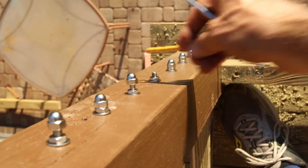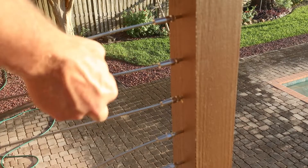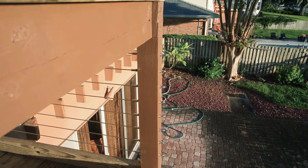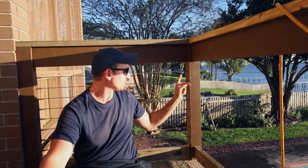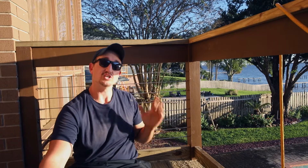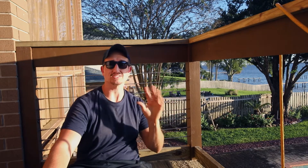To tighten the cables, remove the acorn nut from the stud connector and tighten the tensioning nut with the appropriate wrench, while holding a wrench on the other side to keep the cable from turning. This tightening process is repeated on each cable, working from the middle out to the top and bottom until all cables are nice and snug. I left the bolts long for now in case any more adjusting is needed, but you could cut them down to make the nuts more flush. On this side I ran the through-bolt connections through the 4x4 with eight cables, spaced three inches using the provided template — and they came out nice and snug.